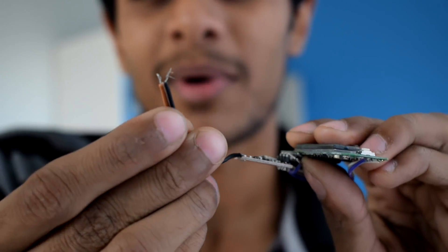I was checking the audio quality and found that this FM transmitter, although it has good range, has its own internal noise. I think this FM transmitter can be used for a loudspeaker application, but it's not really good for this kind of purpose. So I think we need to use a different type of wireless transmitter.